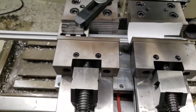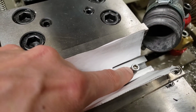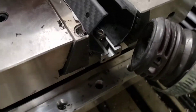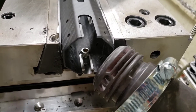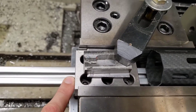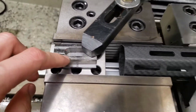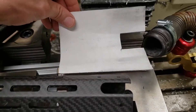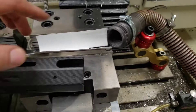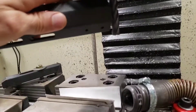We had to figure out some way to align it off of this radius right here. What I did was set up two vices on the table. There's a T-slot down the bottom of the 80-20 extrusion with a screw clamped in there, and that screw aligns up with that radius — the screw is the stop. The way I held the 80-20 extrusion down was to clamp it in the other vice using a hold-down clamp. We're using some paper — two sheets — to keep from scratching up the carbon fiber tube when it gets clamped. We also have vacuum here and up top, with a very long cutter, trimming using the flutes.